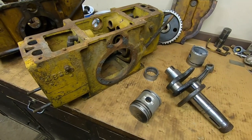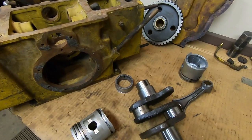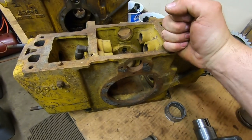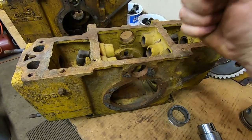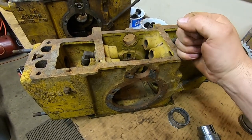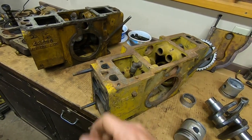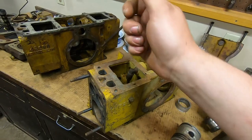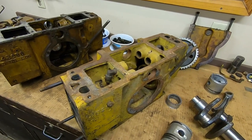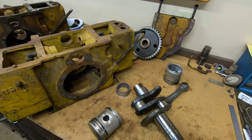When the rod finally let go from the crankshaft, most of the bottom end is gone. There's a mark here corresponding to a notch knocked out of the cylinder wall — that's where the rod came to rest, and the crankshaft came around and pounded down on top of it, creating this big gouge. That's pretty much par for the course when you let the crankcase get diluted with gasoline. The mag switch is really only for emergency situations; if you're just operating the machine, always run that thing out of gas — it's going to save you so many problems.